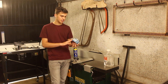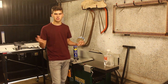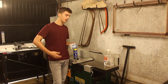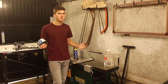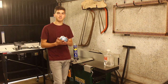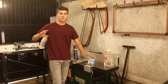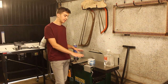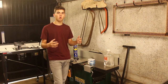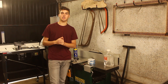The next product is Machine Wax by Axminster. Later in this video I'll show you how to apply it, but I highly recommend it — it's cheap, and I think Axminster does worldwide shipping so you can get it anywhere. You get a paper towel, put some Machine Wax on it, rub it into the cast iron top, leave it to dry for maybe 30 seconds until it hardens a bit, then buff it off. This has two benefits: obviously it will prevent rust, but it will also make your cast iron tops silky smooth. So on your table saw, band saw, or planer thicknesser, the wood will just glide over the top — it'll be much easier and safer to use.